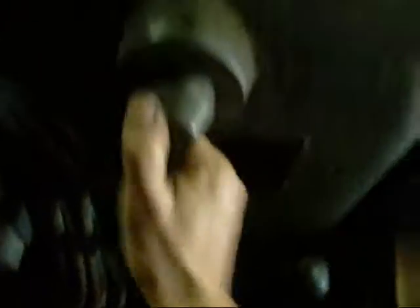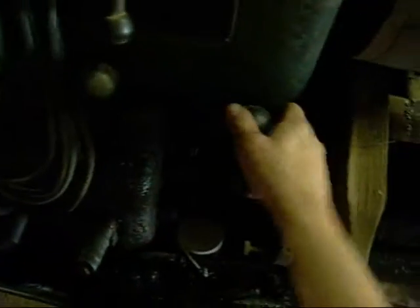Pretty clean inside the gearbox though — a bit of oil in there. Speed 1, Speed 2. I'm not sure if we can engage these on the fly; most turret lathes you can. So you start with the spindle and then you can adjust your speeds on the go, just like your different processes — everything can be done on the fly, you don't have to stop it.